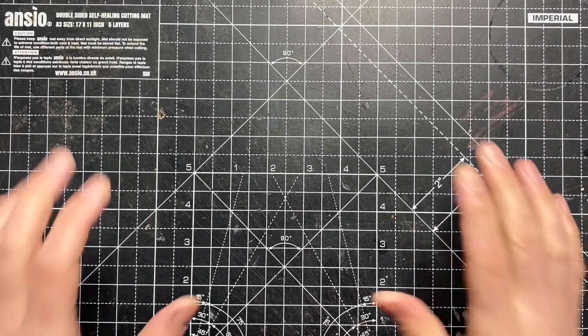You will have noticed here that I'm no longer carving down the leg — I'm carving upwards. The reason is that if we continue to carve down the leg towards the hoof, what would happen is we'd actually end up splintering and tearing off chunks of the wood. The flow of the grain here is going horizontally across the horse — it's stacked in layers — and if you continue to carve down towards those layers, the last layer is going to snap off and pull away. So the very base of the horse's hooves you need to carve upwards, and then you can continue to carve down but you must stop before you get to those hooves.